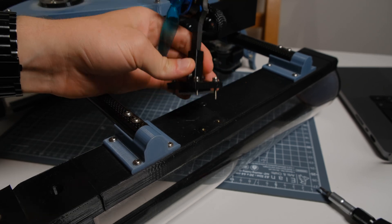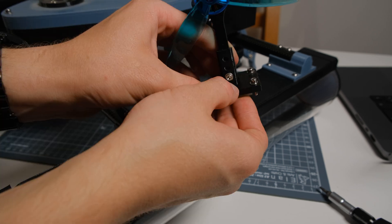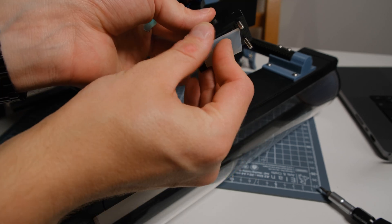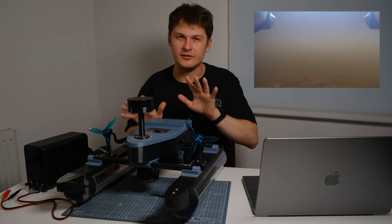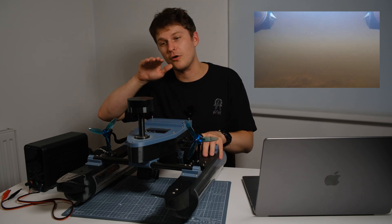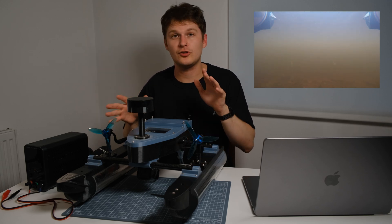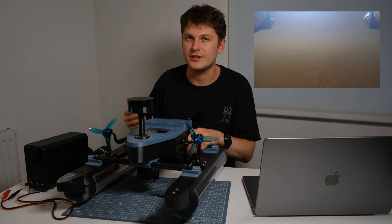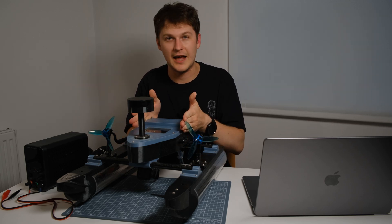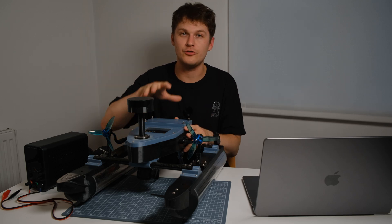The way the motors are mounted uses a rubber plate underneath and a rubber plate on top. As you screw it up it wedges the mount between these two rubber pads — the aim is to stop vibration getting to the hull as much as possible. Whether it does that is another question; you can still hear the drone motors in the underwater camera footage, which is why I'm looking at having a bigger motor or possibly moving to EDF fans as someone commented. I tried to keep as much space inside as possible for future developments.